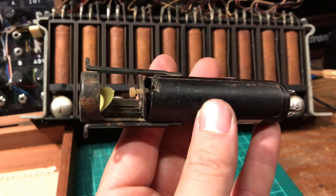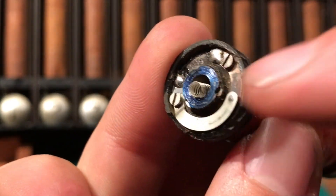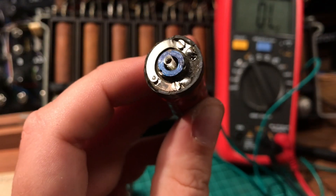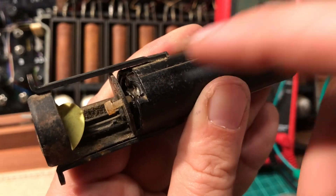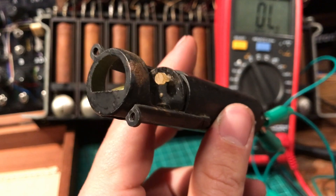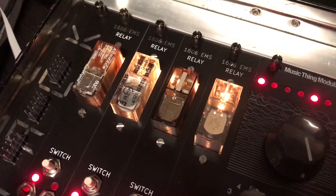Pretty simple, really. But there's one more trick up its sleeve, because it's actually a switched indicator - pretty clever. On the face of this coil there's a little switch: a metal contact running around here and one running around here, and they're not actually touching. They only touch when this one is pressed in. I've hooked it up to the continuity meter off the two terminals on the back, and if I press the two contacts together - there you go. When the coil is put in the indicator, those two switch contacts are pressed together by this little screw, and it's adjustable so you get the right amount of travel. So it's not just an indicator, it's actually an electrical relay as well. Good news is, if you want an electromechanical relay switch in your synthesizer case, I make these modules - the 1606 electromagnetic switch. You can click on the demo or the shop link at the end of the video.